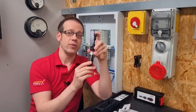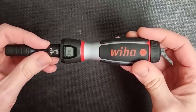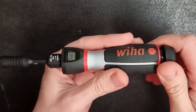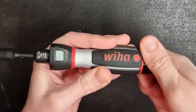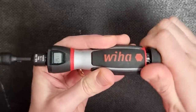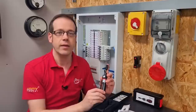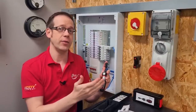Once calibrated, a long press on the power button from the click-count screen will reset the counter to 5,000. To change the torque setting, look at the back of the driver — pressing a button there causes the dial at the back to move into the torque-setting position. Twisting that dial changes the torque value up or down. Once you've set it to the desired value, press it back in, it locks into position, and you're good to go.